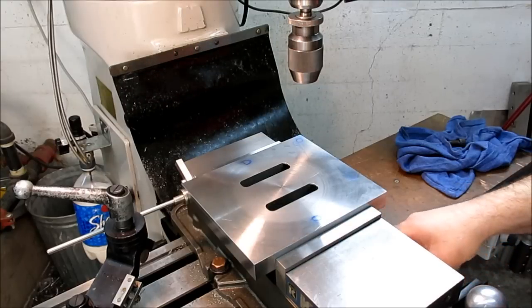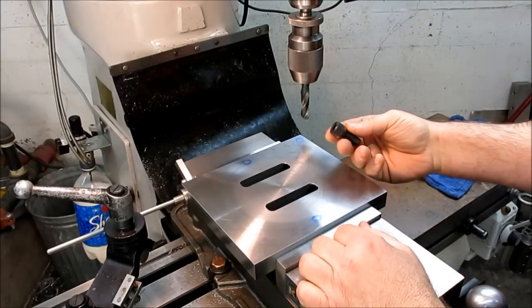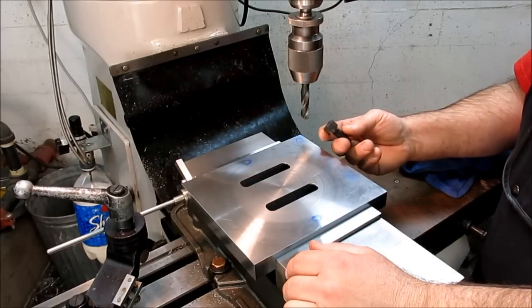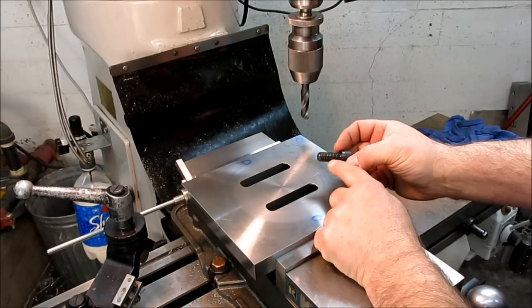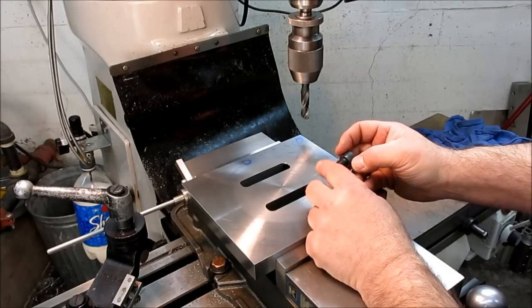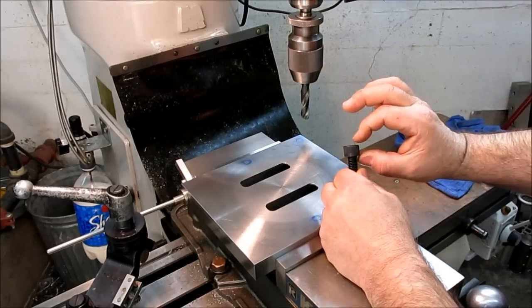Kind of set up over here, ready to go. There's nothing too magical about holes and counterbores. This is a standard inch socket head cap screw. People wonder about the depth to set the head down with these. Just nominally, whatever the nominal screw size is - in this case it's a half-inch diameter, this is half-13, almost 13 millimeters - the depth of the counterbore is equal to the nominal diameter. So if that's half inch, the depth for this counterbore would be half inch. Now, that puts it kind of right at flush.